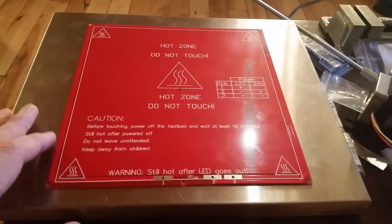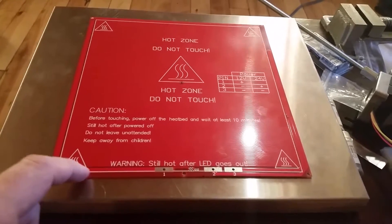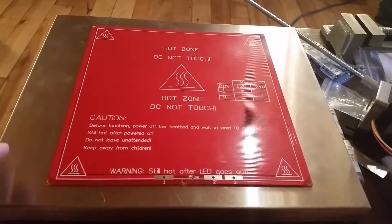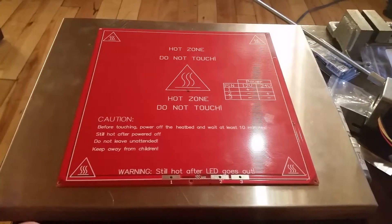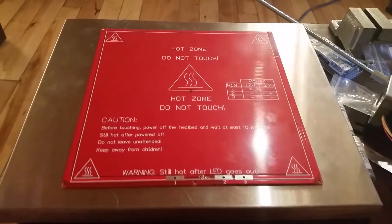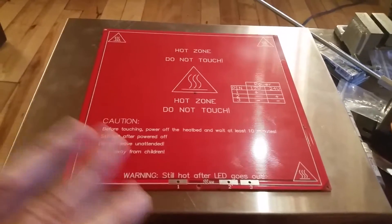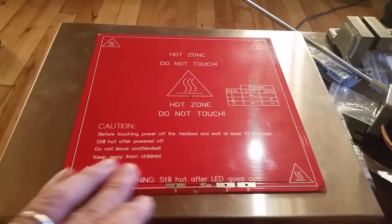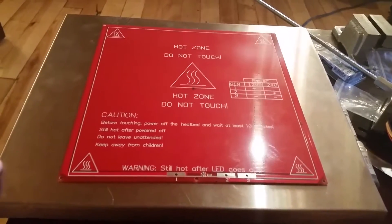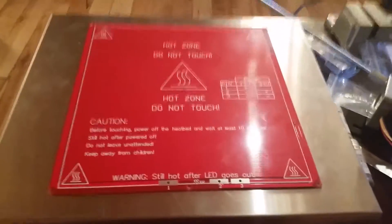How did I fix this? Very simple. The glass transition temperature for the type of fiber or resin used in these boards is quite high — I think it's in the 300s or so. Much the same as we heat our PLA and extrude that, there's a temperature at which it transitions from solid to non-solid — the point that it's malleable. What you do, especially before you've soldered anything to your board, is get two pieces of metal. In this case I have two pieces of stainless that's actually the side of an old barbecue, and I sandwiched the board between the two pieces of metal.